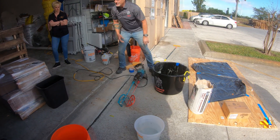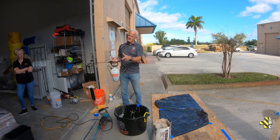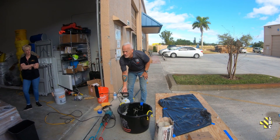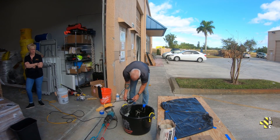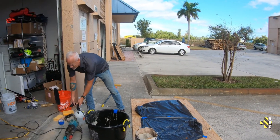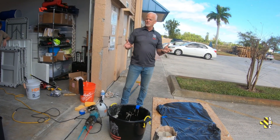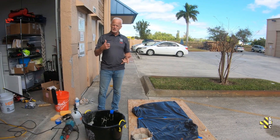I'm always going to have lots of extra five-gallon buckets, usually a couple extra with water in them because I want to keep my tools clean. Amen to that. Tools clean are very important. Especially with concrete — no concrete product likes a lot of water because you pull cream to the top. Since this is all cream, it's not a big issue. I'm not worried about pulling cream to the top.